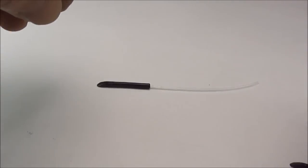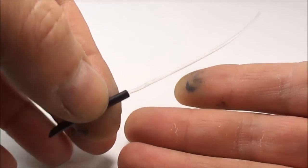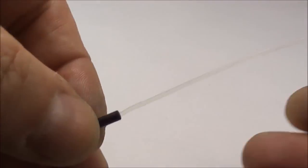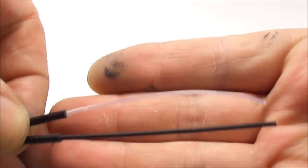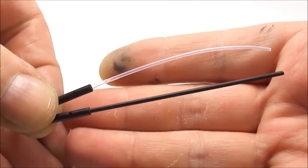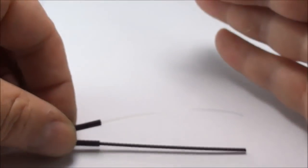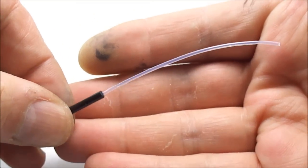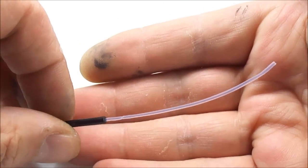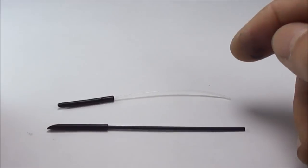We're back again now. I've actually done this from behind the camera because it is a little bit of a fiddly job and I couldn't do it in front of the camera — I need to use the loupe. But there we have it: we've put a new breather tube to the end of the feed there. I'll just show you a normal one — it doesn't matter the fact that it's bent like that, that's no problem. What we've done: we've removed the old piece of the breather tube from the feed using a small one millimeter drill bit.